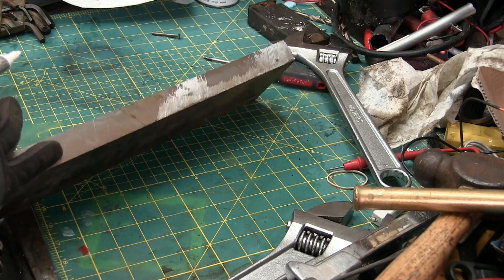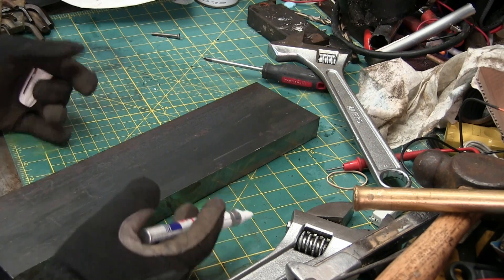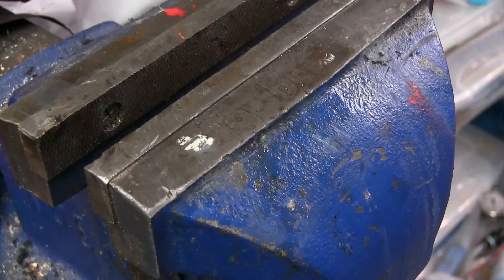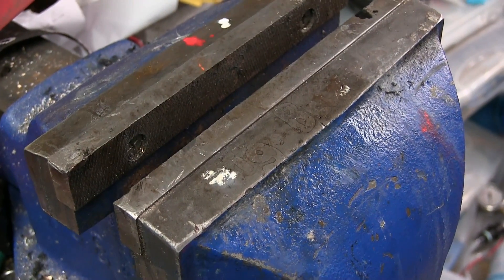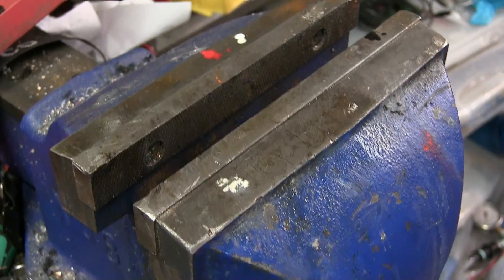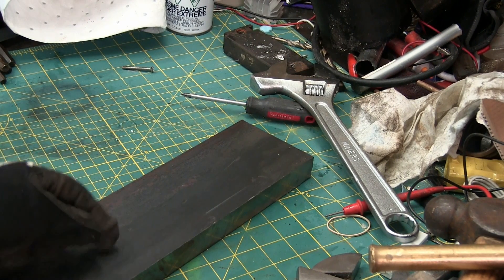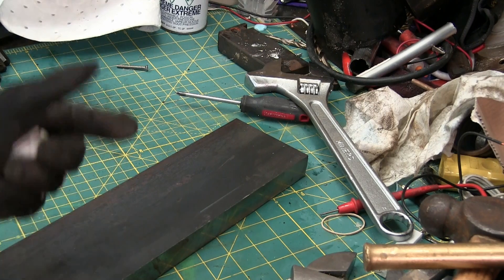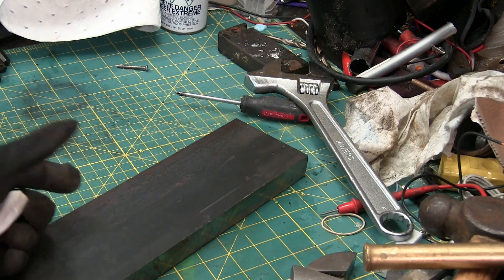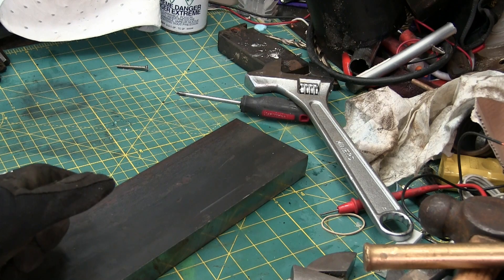The plan is we're going to start off with some A36 one-inch thick - might be W44 - mild steel. The reason we're going to use this instead of the trusty bench vise is because even though Big Bertha is an eight-inch Record, two-ton press capacity, two tons is just not enough. More tonnage equals more better. Each half-inch Grade 8 bolt can do 12,000 pounds - six tons. So we put four of those in there - that's 24 tons.